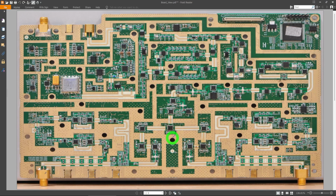So let's look at the front and see what we can observe right away. Now first of all, this has an axis of symmetry. You can see that the stuff here on the left and the stuff here on the right look very similar. That is to be expected. This is a 2-port network analyzer, and there has to be an axis of symmetry somewhere in the middle of this, because port 1 and port 2 are identical in operation from a network analyzer point of view. So here's port 1 here, and here's port 2 on the other side. There are also 3 other connectors you can see on the right and left. Again, they're symmetric, and 3 connectors here on the top left, which we will talk about.